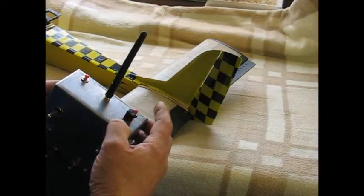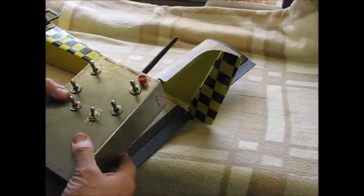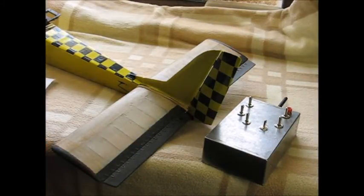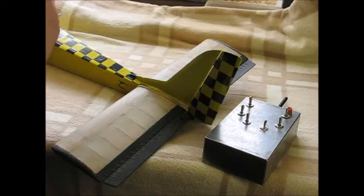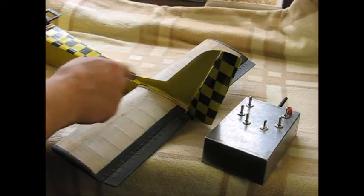So we've done the transit speed, the ATV, the button trim option, and single channel. It has an inactivity timer whereby if you leave it and don't touch it for 10 minutes it starts beeping. The resolution is one microsecond, so it's really smooth. It has the option of a V-tail mixer — just put a link or a switch on D7 — and that sets rudder and elevator into elevon mode, whereby both servos move up on elevator, both move down on elevator, and on rudder they move alternately. We've also seen the range check sweep mode.